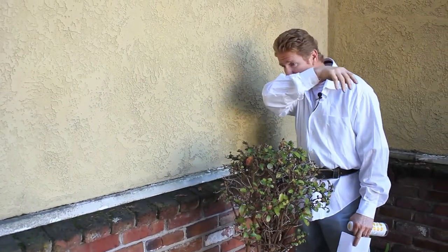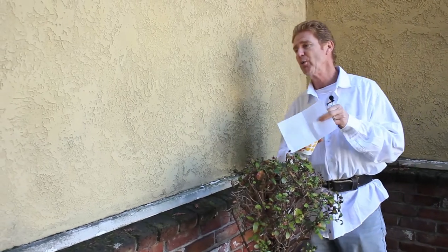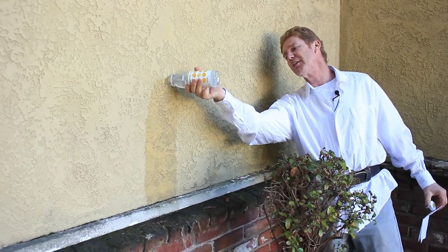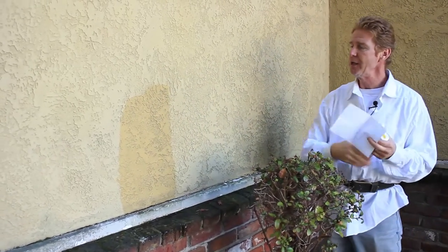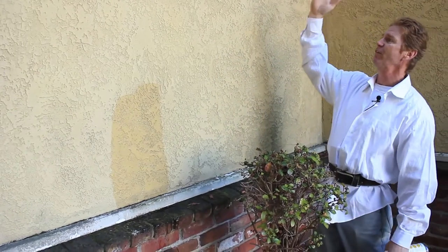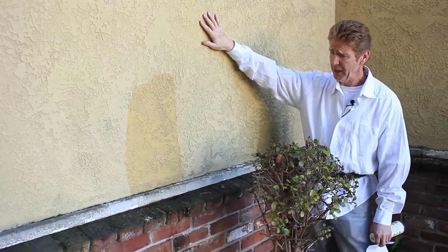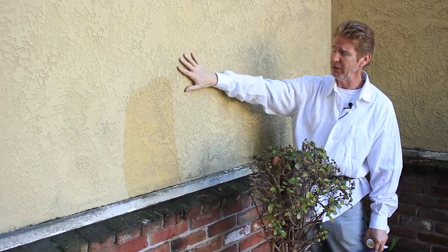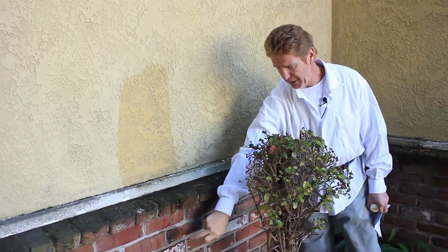Well, I'll tell you why — that's not something we do. First of all, I'll give you an example. This is a color coat maintenance-free finish, and when you wet a color coat maintenance-free finish, it darkens just like the brick will. When your house darkens like that, that means the finish here is 55 years old. They started doing color coats around 1926 — at least La Habra did — and Wester and Omega, all these other ones came afterwards. But this finish is at least 55 years old, and when it darkens like this, like the bricks, that means it's maintenance free.